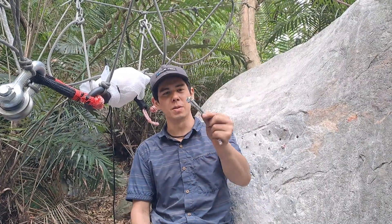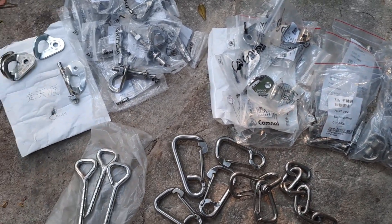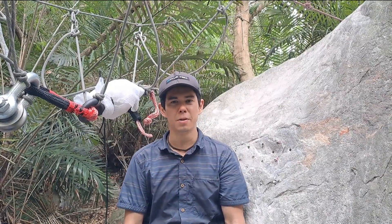Here are the numbers for breaking this wedge bolt — we got somewhere in the 40 range in shear and in tension. In our next episode we'll show the sleeve bolts too. We have in the works breaking of all kinds of bolts, hangers, and hardware manufactured here in Taiwan and also in China, so stay tuned for those episodes.